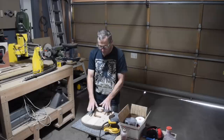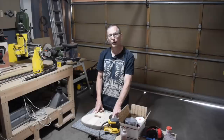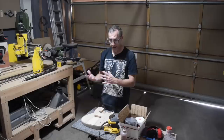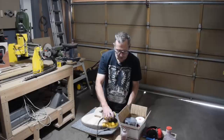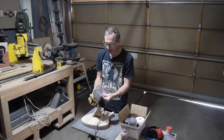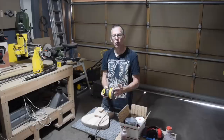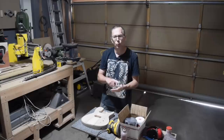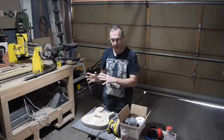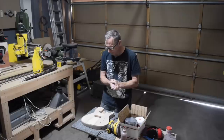For this project I decided to try a different type of abrasive sanding product with my random orbital sander. In the past I used hook and loop paper discs, sanding with 80, 100, 120, 150, and 220. The product I decided to try is Mirka's Abranet. It's actually a mesh and comes with an interface backing pad. It's available in grits ranging from 80 all the way up to 600, and the assortment kit includes 80, 100, 120, 150, 180, 220, 320, 400, and 600 grit. I typically sand from 80 to 220 so the higher grits I didn't bother to use.